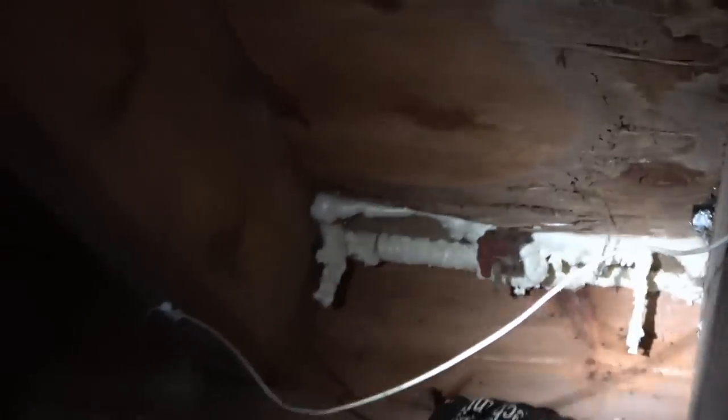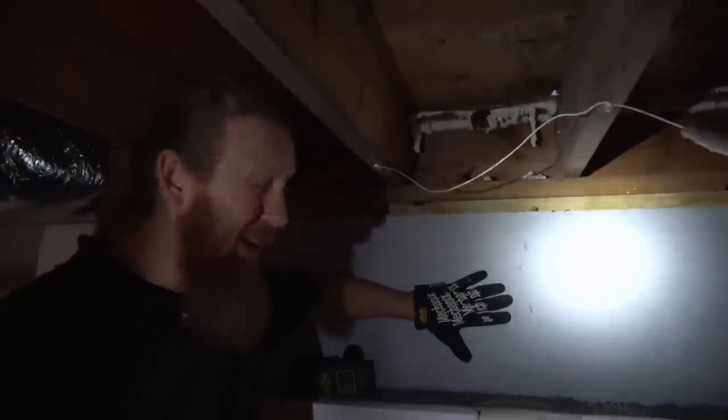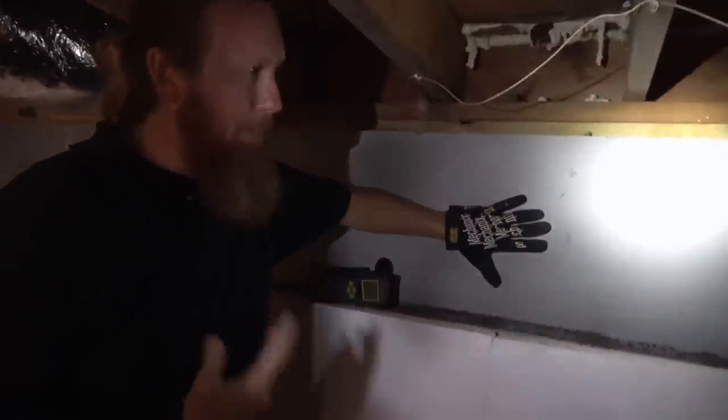If you notice right here, we've got a little bit of subfloor damage. This is the front of the house — they were getting some moisture coming in. There's a high-traffic road in front of the house and the ground slopes towards the house. That's partly why they have this area painted — they were trying to stop the moisture by painting the cinder block and it didn't work. Painting cinder block does not work as a waterproofing solution.